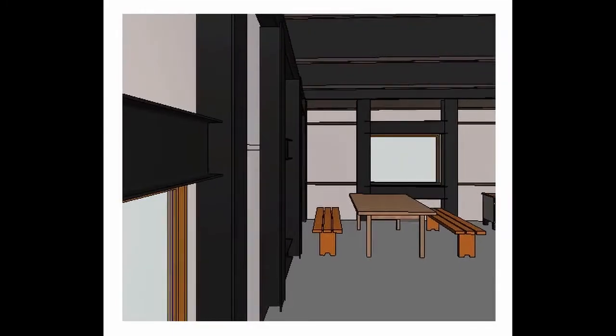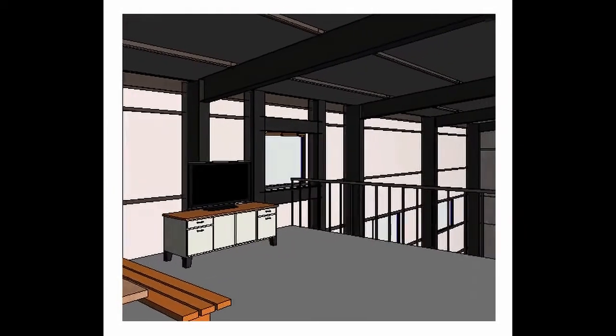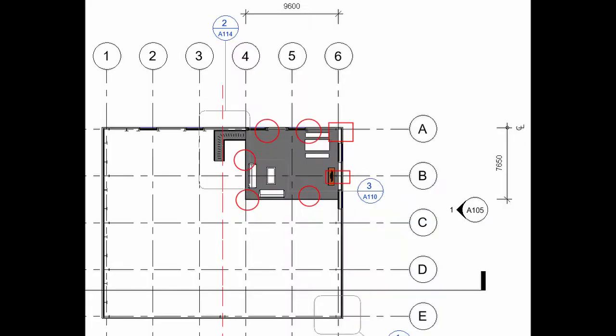The mezzanine level has an area of 73.5 square metres. A 150mm concrete slab is used for the level, supported by 5 additional columns, along with the 2 columns that are there to support the building frame. Gusset plates were used throughout the build to ensure a secure connection of the Z and C sections to the columns and rafters, respectively.